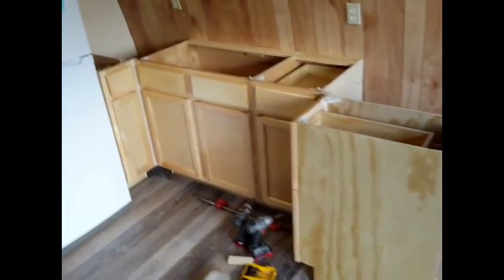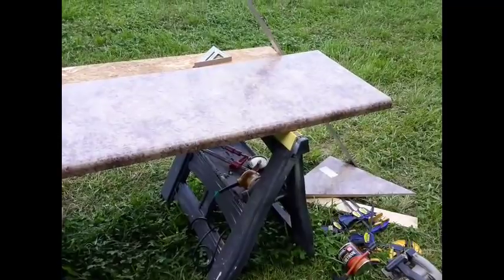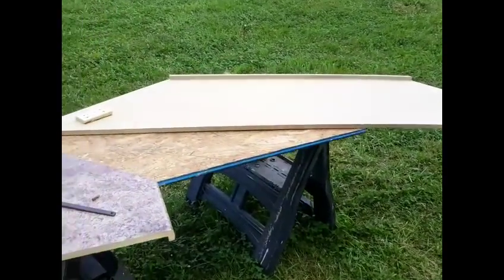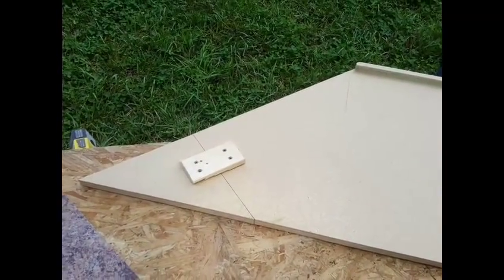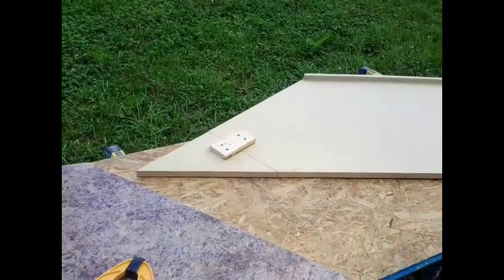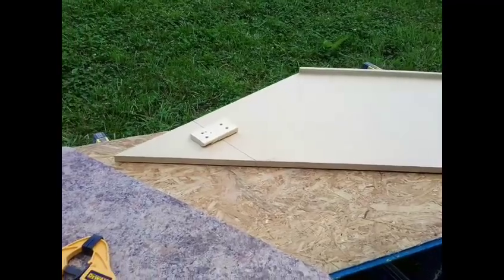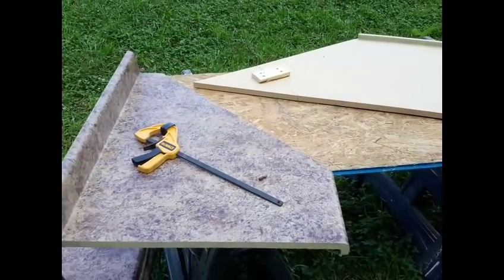I'm going to go see if I can make do on this countertop fiasco. To prevent me from throwing this thing away here, I used a scrap block to reattach the piece I cut off, and I cut the correct 45. Now I'm going to make some little clamping blocks to attach, and then I'll get on to working on my miter joint here.